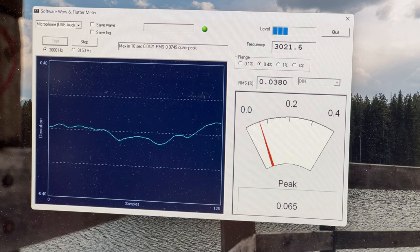He's got three different tape types up here. There's the ANT Audio LO4 tape up here. There's the HPR 200 tape. Well, that's the one I've got, so we're going to be using that value. Then there's a newer HPR tape at 250. And there's readings for that tape as well, but I don't have that tape, so I'm using column number 2.